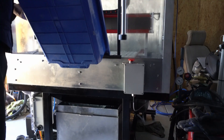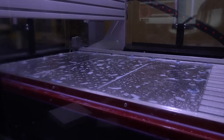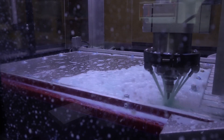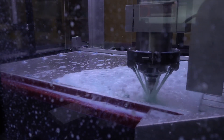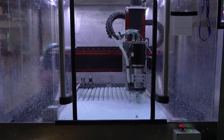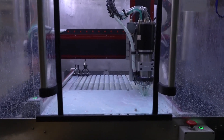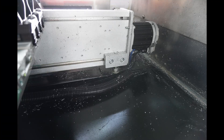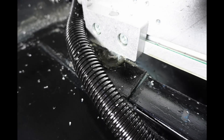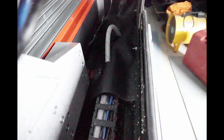Waterproofing. Waterproofing the chip tray and enclosure was actually a bit more difficult than I hoped, due to an engineering oversight on my part. My design has bolts going through the frame where the machine feet would normally be sitting on a bench. These bolts were much harder to seal than I thought and coolant was leaking into the frame. I basically just coated the bolts and load spreading plates with silicone and that solved the problem. A better design would have plates coming off the frame that the bolts go through, such that the bottom of the plate is still inside the wet area of the enclosure.